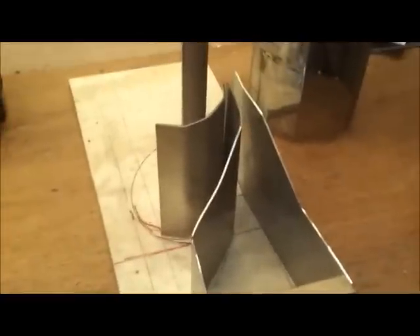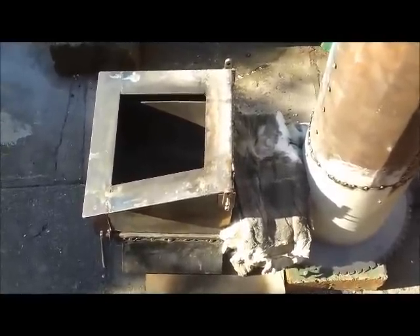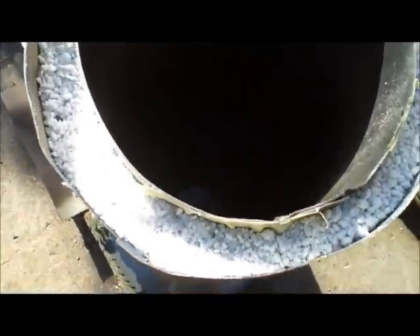It's test day. I've tagged the firebox just on the front - not attached, literally just pushed on - and I've wrapped a load of ceramic wool around it just to keep it airtight. I'm not going to bother with the top. The riser tube is in, I've put the shroud around it and put the perlite in. It's sat on an old saw blade so I can put the internal centre tube in. I'm going to light it, so let's see what happens.